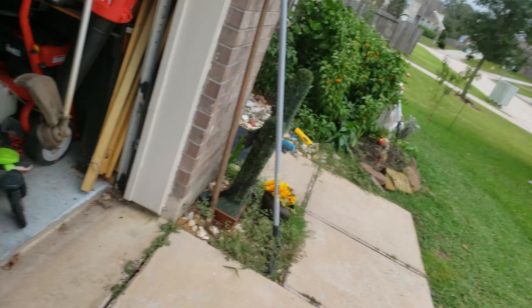That caused two things: this thing wasn't spinning as fast, and it caused some damage to my driveway, which I'll show you. You can see that big two-foot circle right there — I did that. And I did another one over here that's not quite as bad, but it's there. I just want to show you guys this so you make sure you have your nozzles facing the right way. Don't make this mistake at a homeowner's house or at a business because it can cost you — somebody could sue you for something like that because it is permanent.